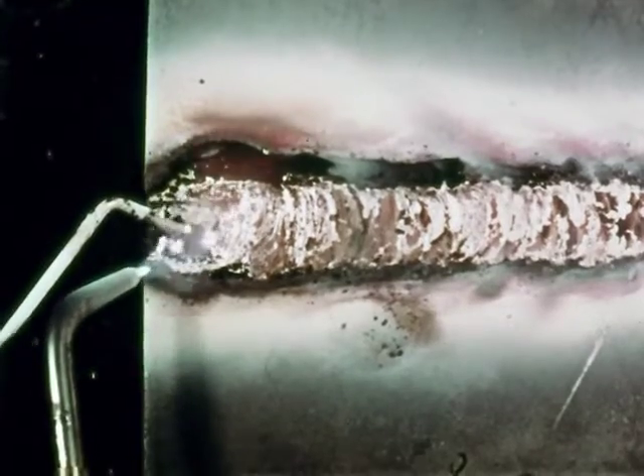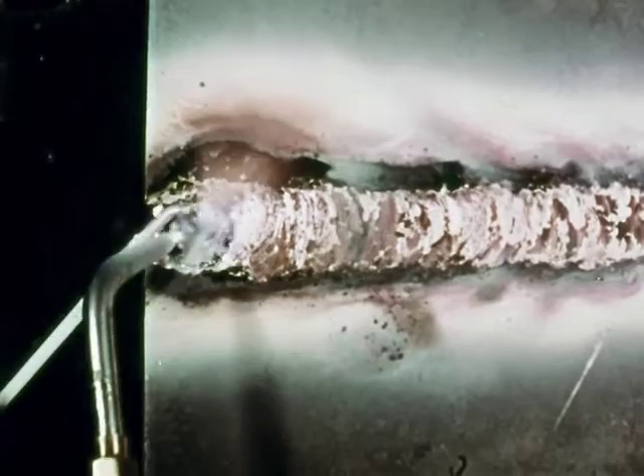As you practice, you'll find that controlling the puddle becomes easy. The hottest part of the flame is right at the tip of the inner bright cone. The size of the puddle can be controlled by moving that hot spot closer to or away from the puddle surface — the same is true of the rod. Don't forget to build up the last pass for additional strength — make it a little higher than the surface of the plate and a little wider than the top of the V. You can control the puddle better by changing the direction of the blowpipe when you reach the edge of the plate — point it towards the finished weld to prevent the molten bronze from flowing out of the open end.